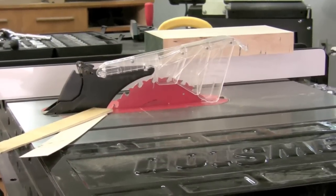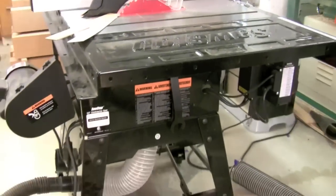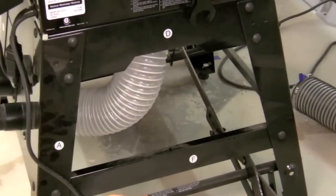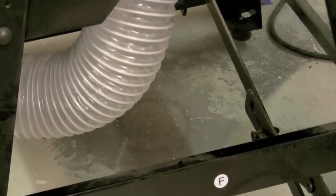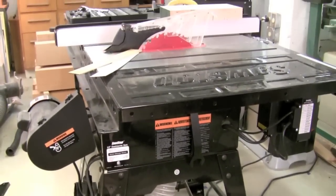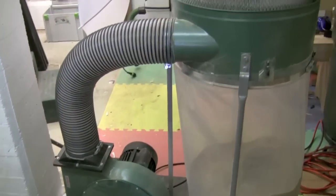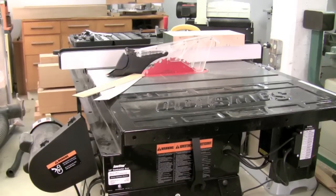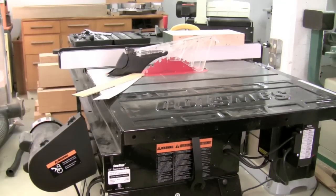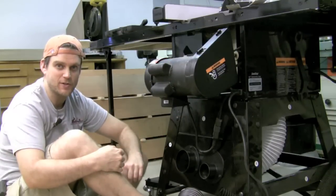After two rips through 8 quarter maple you can see some spray of dust on the top — just a little bit — and if you go down beneath the saw you can see a little bit of spraying on the floor that wasn't captured, just some speckles. That is with a shop vac. I've been using this saw for a couple of weeks with my larger 4 inch dust collector, and it collects about 90 to 95 percent of the material, leaving some dust spray both on top and underneath. With the shop vac and a couple of test cuts, I'm seeing pretty much the same performance.